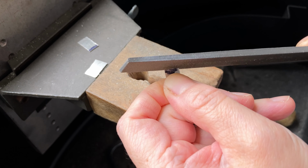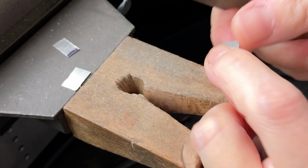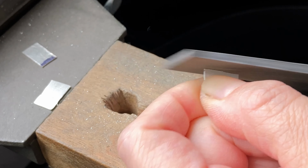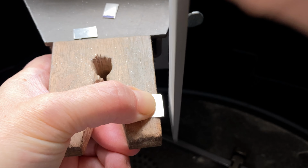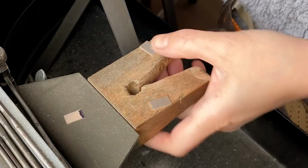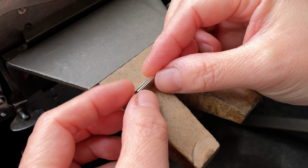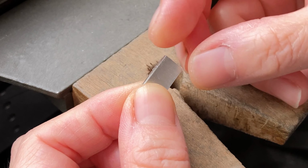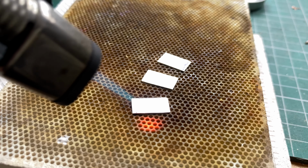Now, I have all my pieces cut out. I try to get every single edge and angle straight. When the 3 pieces are stuck together, they will look like this. I notice not all the pieces are flat, so I anneal them to make them soft